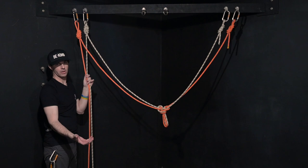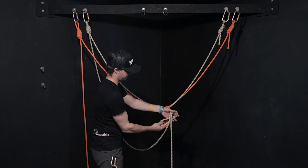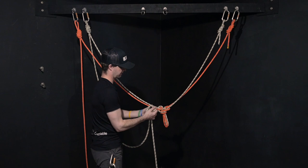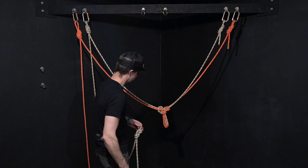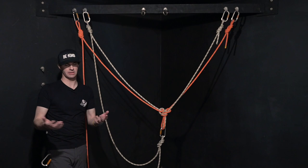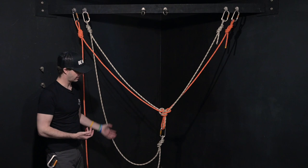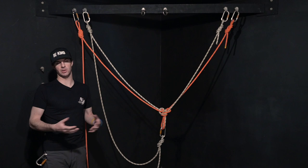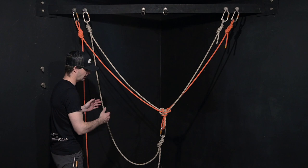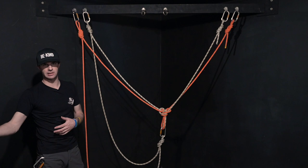You're going to need a couple extra carabiners. When it comes to rigging up re-anchors, it really depends on what you were trained. The question I get a lot in training is, when you rig up re-anchors, how much loop or how much rope do you need? I like to say approximately one and a half times the width — so if this is one meter, then I need to make sure that I have about a meter and a half of rope to play into the loop. At the end of the day, there's no too much unless it's going to hinder the situation by coming in contact with something, but there is too little.